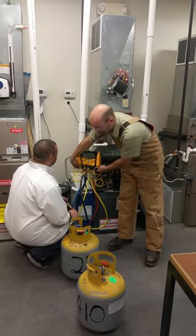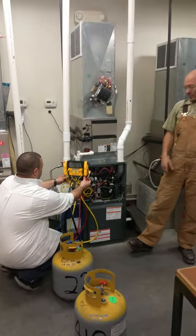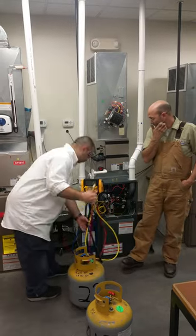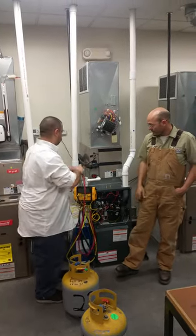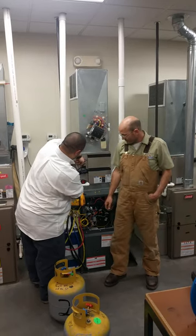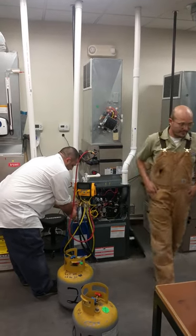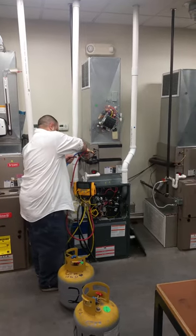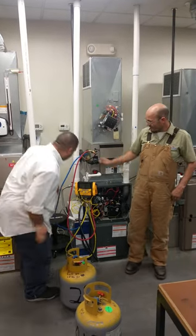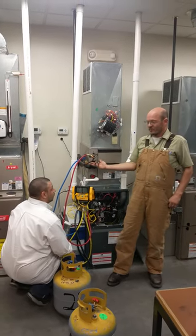We're going to make sure all our valves are closed — we don't want any surprises as we're going up the system. We're going to make sure we've got Schrader ports in there. Go ahead and look at your hoses. We're going to stretch your hoses out, move this into position. You're equalized so you've got a good solid feed on both sides.